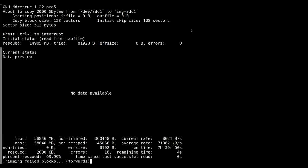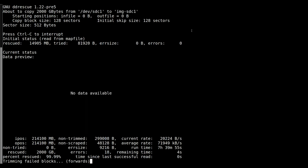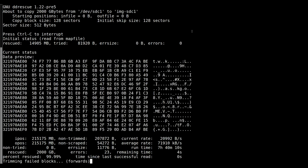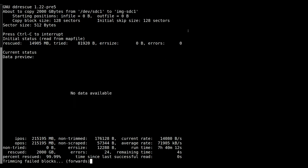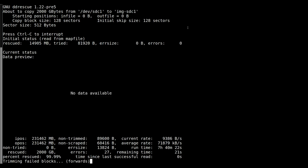I'll do another video where I will probe around the pins, see what's going on, and then post up what possible equivalents we could use, because I know there's quite a few other people who have failed Western Digital MyBook controller boards and the same sort of thing. They've tried replacing it with other ones, it doesn't work, and the only solution, at least for us normal people, is to repair the board. So long as the controller itself isn't damaged, assuming it's a power supply issue, then there's a pretty good hope of getting the data back finally.